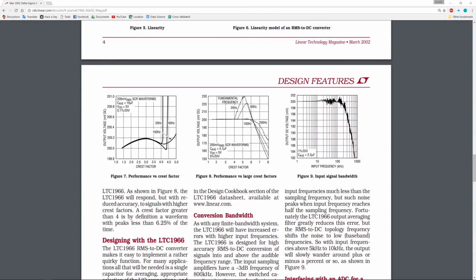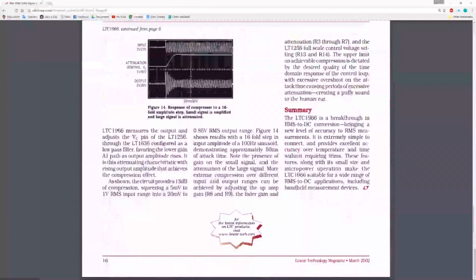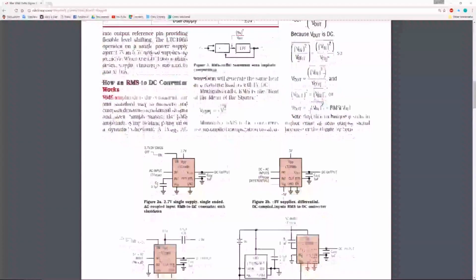The same thing applies to the voltage as well. I scoped the mains voltage and it's not exactly a sine wave. I don't know what made me think that it would be a sine wave all along, as an assumption from all the textbooks that you've been looking at. But it's not a sine wave, and it's a little bit more involved getting the RMS value from that. So this is a very interesting circuit that we are looking at. That's what I'm going to order, and hopefully we can get something going here.